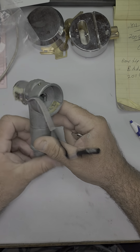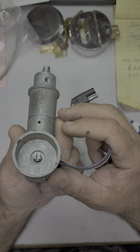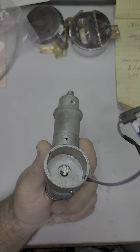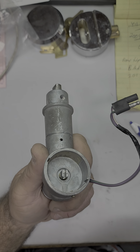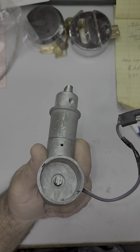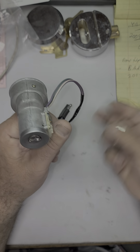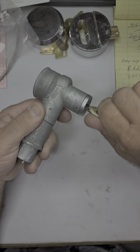But this one — when they took the plug out, there's a paper tag in there, and the paper tag, the first three numbers: 773. Now, they don't tell you that the first prefix of the code — they only give you the numbered code — it's FR. So unless you knew how to make keys — I've been doing this for over 40-something years — you're going to put in FR 773, go ahead and find that code, which I did. There's the key, put the key in, and it turns beautifully.